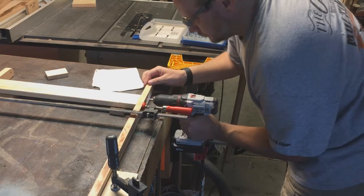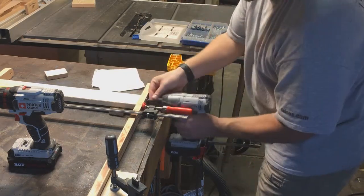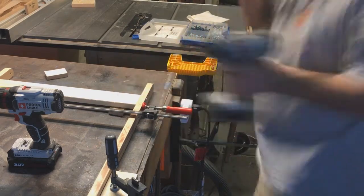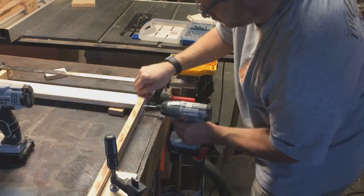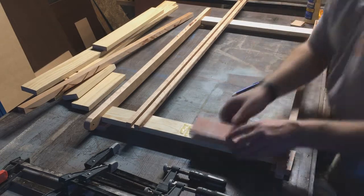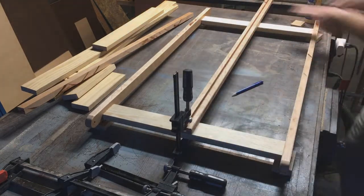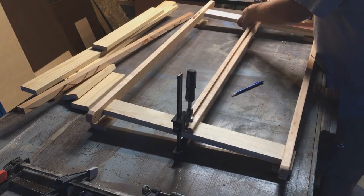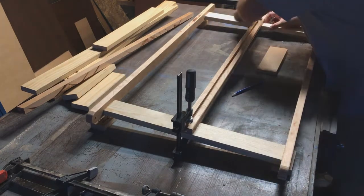I think I've only got about eight screws in the whole project — two, four for the chain, and eight for this piece here, that's 12. Who needs math when you can do woodwork? The mast piece is just a T-track — I ripped a piece of cherry for the T-track. Cherry is on the sides and the center piece of the mast; the rest of the entire piece is reclaimed pine. But you don't want to cut T-tracks in pine; it's got to be a hardwood otherwise it'll just fall apart.